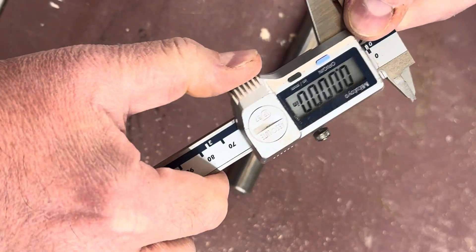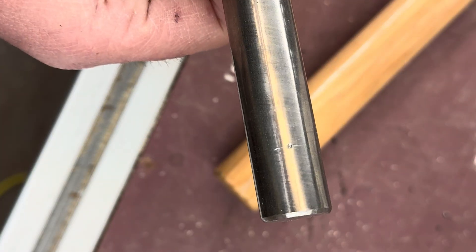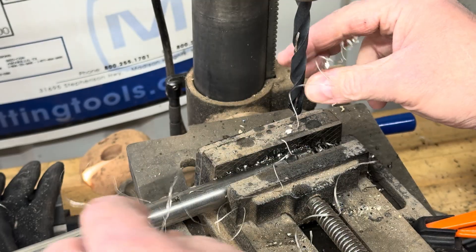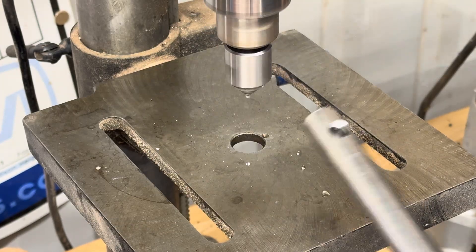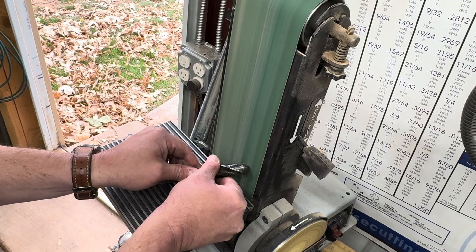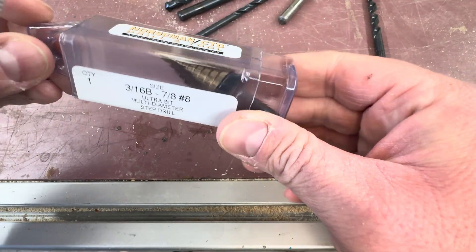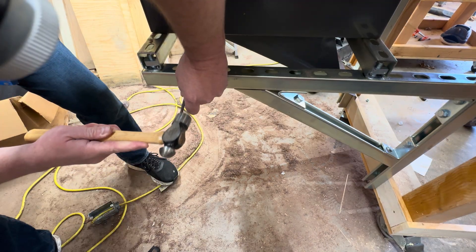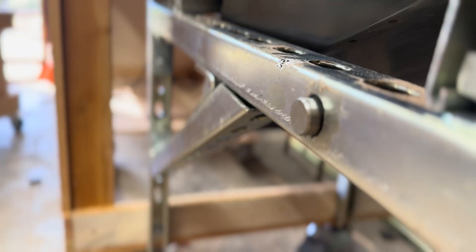I had an interesting idea applying statics to bring this up and square with tension rods. By running two three-quarter-inch rods with holes for about three-eighths all-thread to go through, I can support it in the upper direction and adjust the whole assembly until square — like a turnbuckle. This is reminiscent of bridge structures with cables supporting from above while there are supports below. If you've ever tried to drill a three-quarter-inch hole in sheet metal, you know the pain. I tried a reduced shank drill, but neither the drill nor the bit wanted to cooperate. Enter the Unibit — getting one of these made drilling nice round holes in sheet metal so much easier. The remaining six holes were done in the same time it took me to drill two. Now it was time for final assembly to cinch up my cantilever problem. The ratchet sound and the level straightening out was so satisfying.